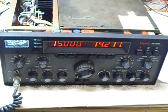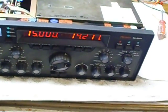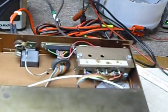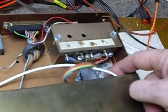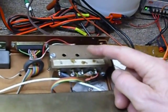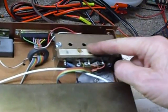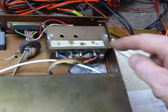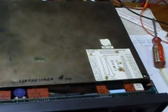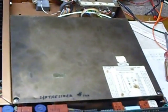I replaced all the rear power connector — I didn't have a connector like that and you can't buy them, so I put in a different type. I also replaced the big Q1 power transistor — that socket was broken too, so I put in a new socket and a new transistor. The power inverter board had two shorted diodes and a burned-up transistor, and those were replaced.